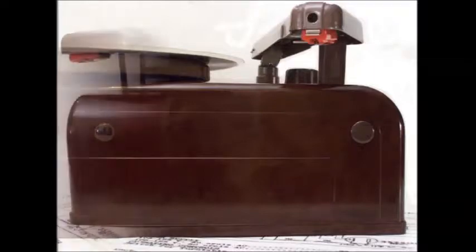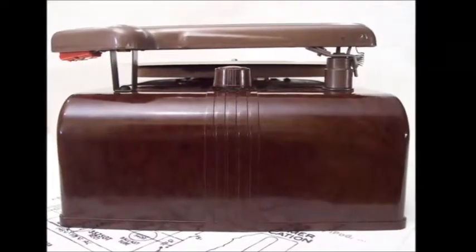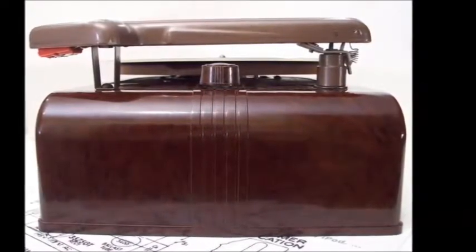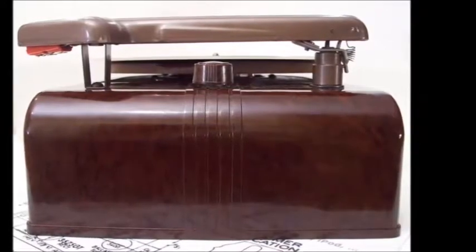Originally they were equipped with heavy tonearms and Astatic steel needle cartridges that are not very healthy for 78s. All my vintage record players are equipped with new ceramic flip-flop diamond or sapphire needle jukebox cartridges and have tonearm weight reducing springs installed.